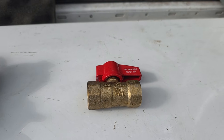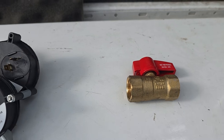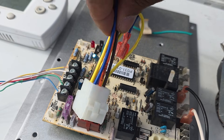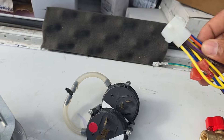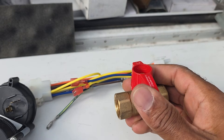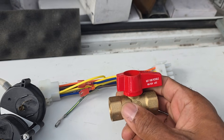I don't have a real gas valve here but when we go to the furnace in the attic I can show you one. Once the igniter turns on, the control board is going to send 24 volts to your gas valve. The gas valve is going to be closed initially, but when it's safe to run - when the igniter glows or sparks - you're going to get 24 volts that opens the gas valve to allow gas through.